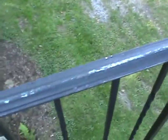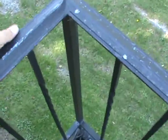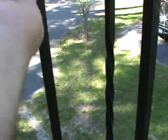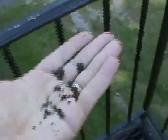In some cases it's simple: you just come in here, cut the molding here, cut the molding there, take this up, get in there, fix, clean it out, then put the molding back. Now the biggest problem you're going to have is that all fire escapes older than 1978 are presumed to have lead. I don't believe this one's going to have lead, but we need a verification that this paint doesn't have lead. Otherwise, the renovator's license applies and you can't weld on this fire escape. So bolting is going to be the only answer on this particular fire escape.